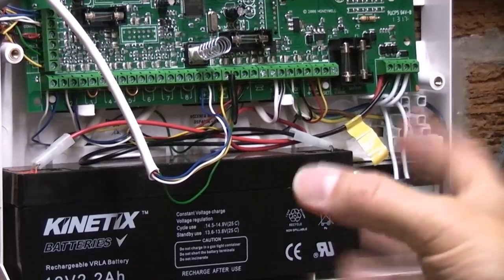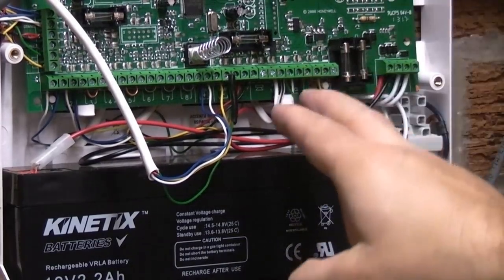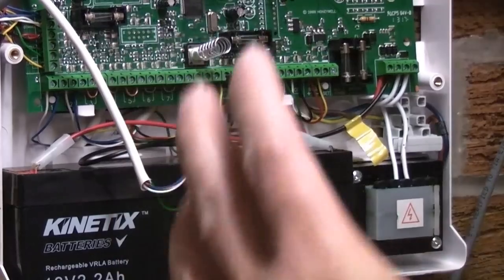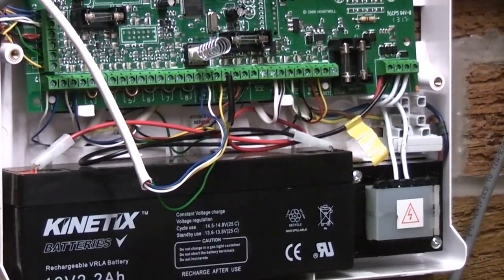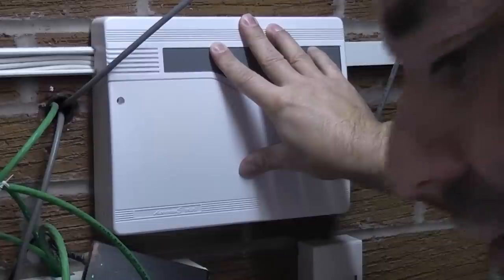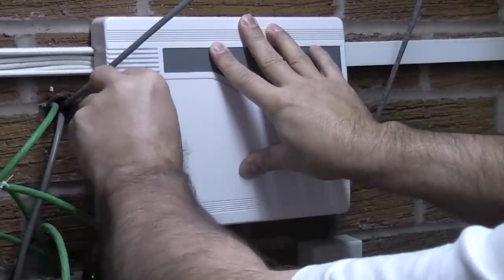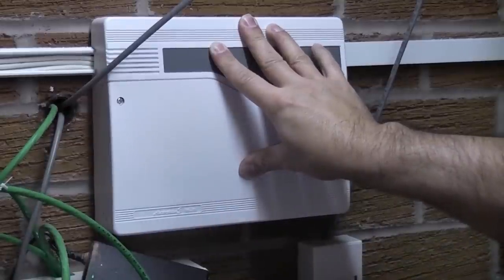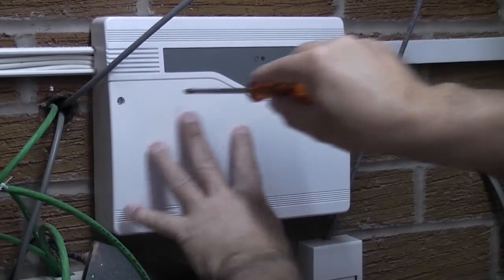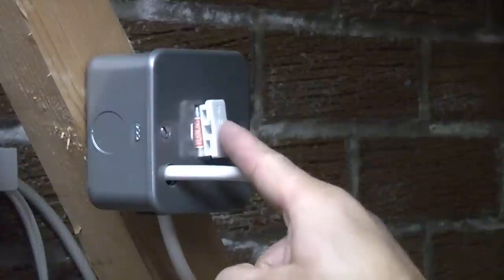It's as simple as that to wire it up in the panel — there's only four wires: two for the actual PA circuit and two for the tamper. Now we've done that we can make sure the cables are out of the way and put the front back on the panel. Push that together — the anti-tamper spring makes contact — then push in the two screws. Once we've done that we can push the fuse back in for the alarm.